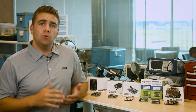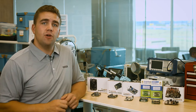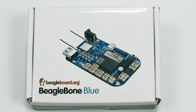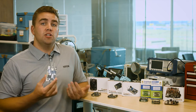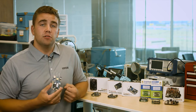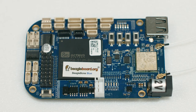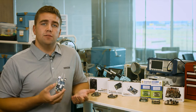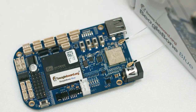If you're an avid robotics lover and want to start building your own creative crawler but are concerned with the depth of embedded robotics development, we have great news. The BeagleBone Blue is a wonderfully affordable and complete robotics controller built around the same powerful processor as the BeagleBone Black. With the same amount of native memory and storage, BeagleBone Blue is much more geared towards robotics because of its compelling set of peripherals. It also comes with an integrated power management system, allowing the board to natively host eight 6-volt servo controls, four DC motor outputs, and four encoder outputs, as well as dedicated headers for other interfaces like UART, SPI, DSM2 radio, and even GPS. The board also comes equipped with a 9-axis inertial measurement unit and a barometer, which makes it a great platform for drone research and tinkering.